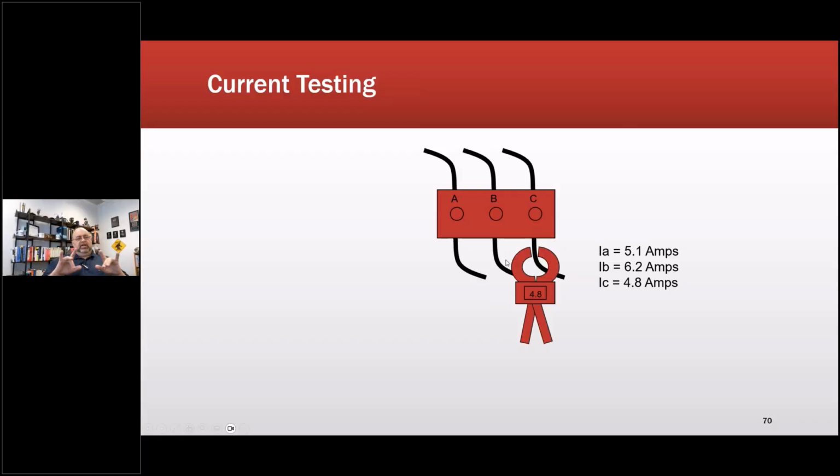So now in a 3-phase machine, if I swap any 2 of those leads, I'm going to reverse the direction of the motor. However, if I take A and put it on B, and B put it on C, and C put it on A, I've rotated the phases. Now, if I measure across it, if it's a small motor and it's a concentric wound or basket wound machine, I might suddenly find that I have balanced current. Don't panic. That means you've got an unbalance up the line somewhere. But if I have a phase impedance issue or something wrong upstream, the unbalance will remain in that phase. So if I have a high B phase, it'll stay as a high B phase. Now, if it rotates, even though the numbers will be different, as I rotate the phases, if they follow so that this high phase B now becomes high phase C, then I know it's on the motor side of things, and that's what I need to investigate.